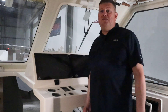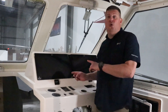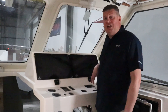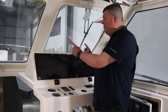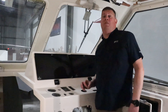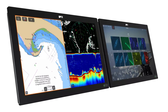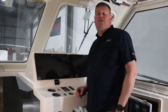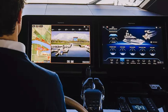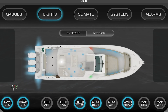Here we are at the helm of the North Coast 415 HT. We're in the factory and everything is getting installed all around us — very much a work in progress, but really cool to be here at this stage of construction. We have a pair of Axiom XL2-19 multifunction touch displays. These 19-inch screens are highly customizable and serve as your interface to GPS and chart plotter, radar, sonar, and FLIR camera feeds. This is also going to be the digital switching touch interface for the boat — navigation lights, pumps, motors, and more, all touch-controlled through a Yacht Sense Link switching system tied into these Axiom XLs.